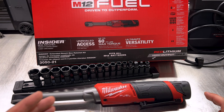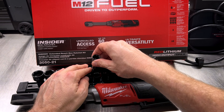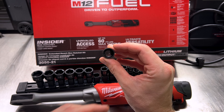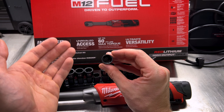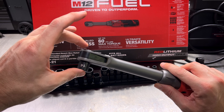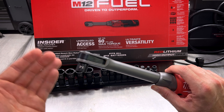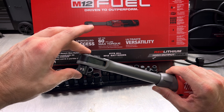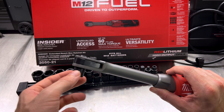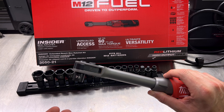A lot of people asked about the pass-through design. This ratchet is not focused on the pass-through design — it is a neat little feature up to 15 millimeter or 9/16ths, but it's not the end-all be-all of what this ratchet is used for. The main reason behind this ratchet existing is the compact overall size of the head and socket compared to other cordless battery-powered and pneumatic ratchets. It is simply more compact as a complete package than a traditional powered ratchet with a traditional socket on it.